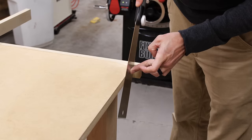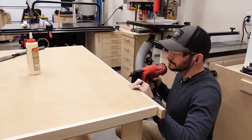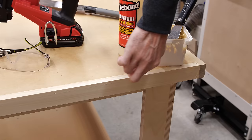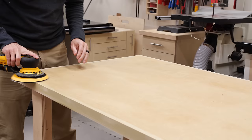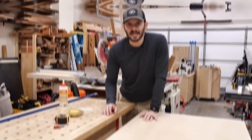After that I used my pull saw to cut the overhang off the short trim pieces. Putting a little pressure on the center of the blade with my finger while cutting helps keep the blade flush to the side and gives a nice cut. After cutting off the ends I put in the final piece of trim and glued and nailed it into place, then finished everything off by flush trimming those long trim pieces as well. I filled the nail holes with wood putty and sanded the trim flush to the top, also sanding all around the edges to smooth everything out and prep for finish.